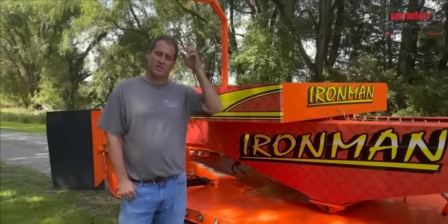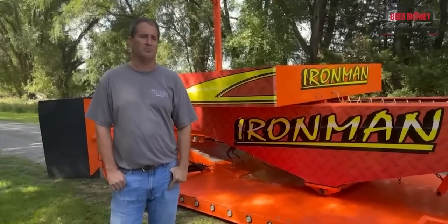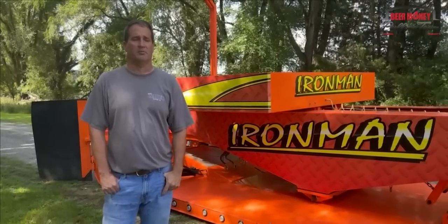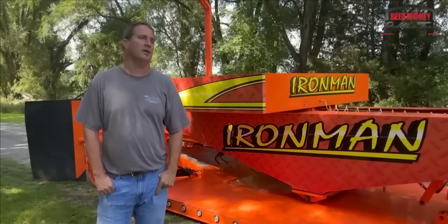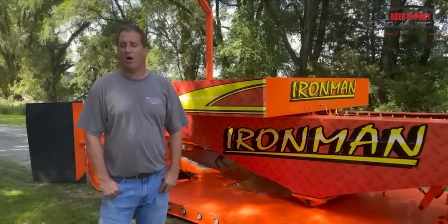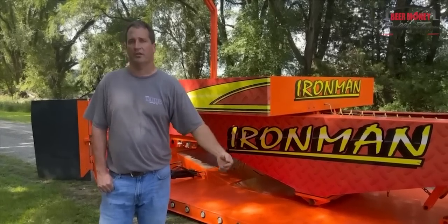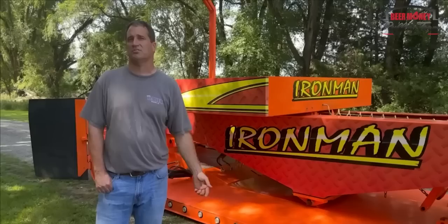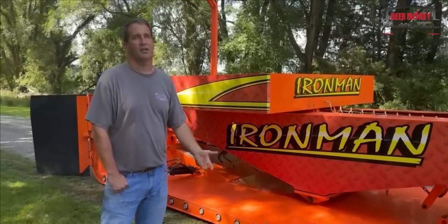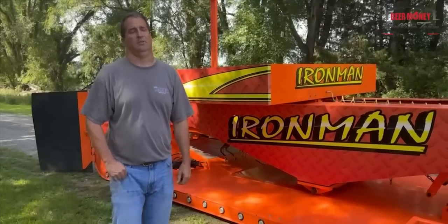Well, do we need to redesign the sleds? Are the sleds capable of stopping the unlimited mods? The answer is yes. The sled has the capability to stop an unlimited mod in less than 300 feet. But the problem with that is that it gets so hard on the puller's equipment that we would rather run the 340, 350, 360 footage and try to save the pulling vehicle. Like a gradual stop instead of an abrupt stop.